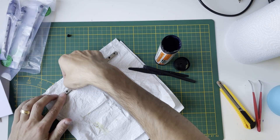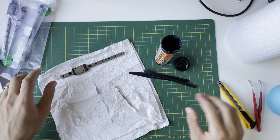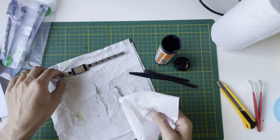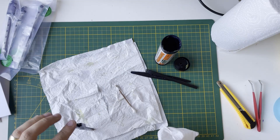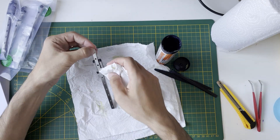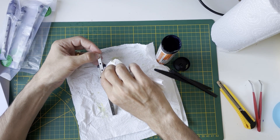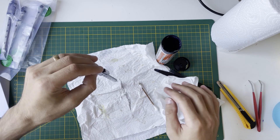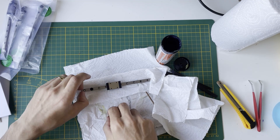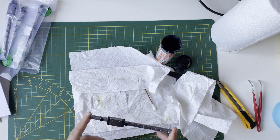I'll put the stoppers back, secure the carriage, and not leave the rails unattended. I will also clean the top of the carriage and the inside of the carriage with isopropyl alcohol. I'll clean the back of the rail as well since we don't need grease there. These side parts of the carriage can be cleaned too — taking out the excess. Looks nice. That's all — now I will continue with the remaining four carriages.